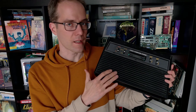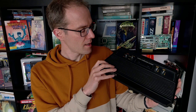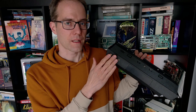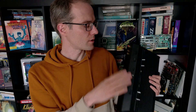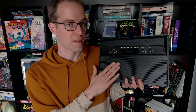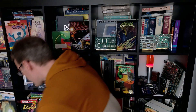It's the 1983 Vader variant, so called because it's all black plastic, and it's a pretty decent sized console. We modded it to have composite out and line out on the back — had to drill some holes — and we made the whole upgrade kit ourselves from one transistor, a couple of resistors and a bit of wire and stripboard. It worked reasonably well and I have been using this for the past couple of years.